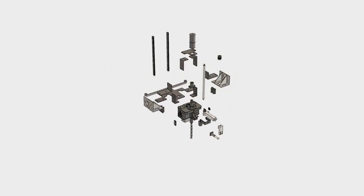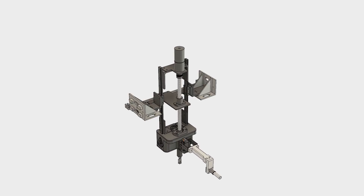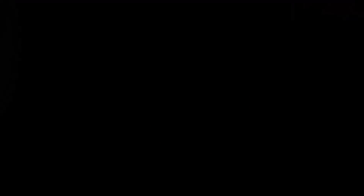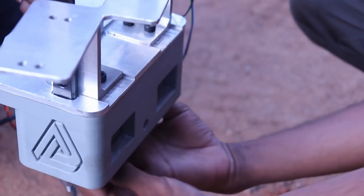Our science plan focuses on evaluating the collected soil samples for indications of supporting microbial life. To achieve this, we have developed a digger which uses a lead-screw mechanism to produce coupled linear and rotary motions of the drill bit. A 3D-printed cache container is located surrounding the drill bit in such a fashion that it is automatically sealed on removal from the digger, so as to prevent contamination of the collected sample.